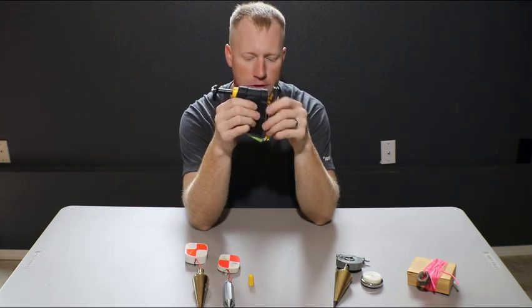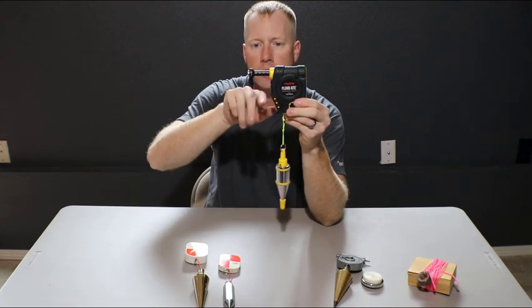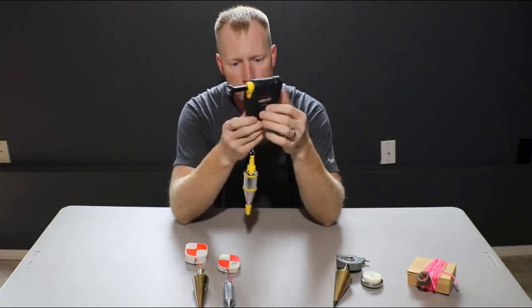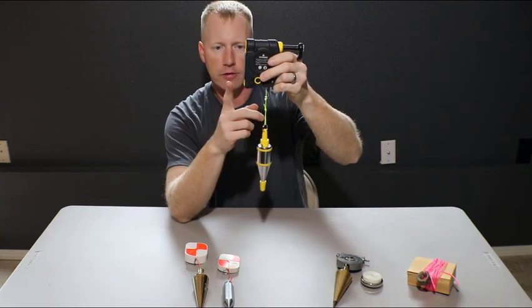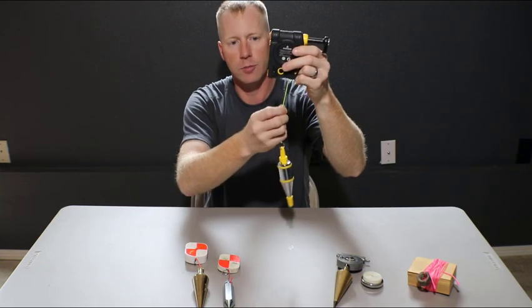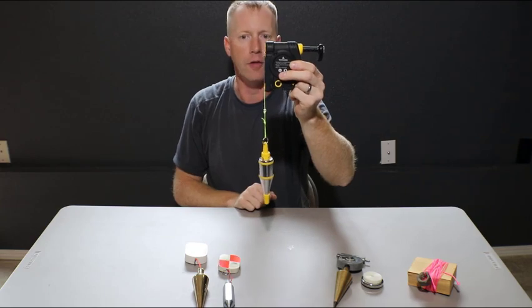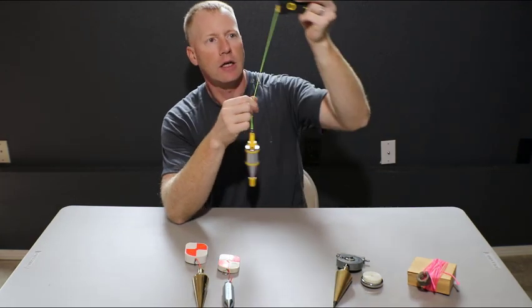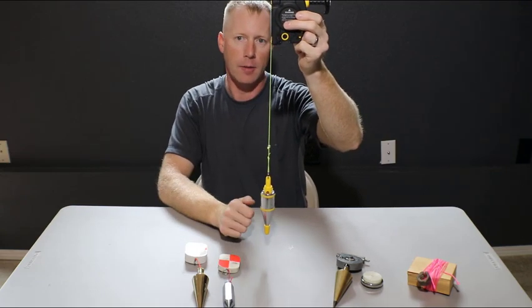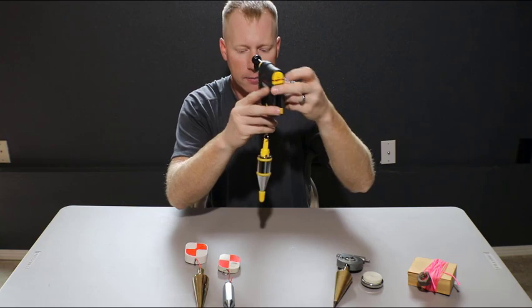The Tajima also has a small rubber cap that snaps onto the tip of the plumb bob. The hook on it is wide enough to hang over a 2x4 floor joist. It's preset so that when flush against a column, the plumb bob string is exactly two inches from your surface. It also has a small pin where you can hook the line flush with the face of the reel, which is useful in situations where you've got a top track on steel studs and you want to plumb down directly to the bottom track without pushing the plumb bob off to the side. Those are the different types of plumb bobs and plumb bob reels available.